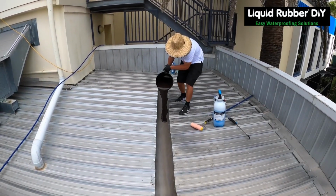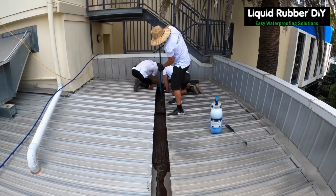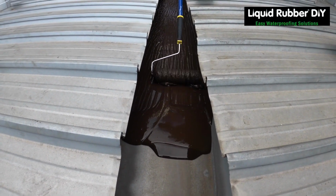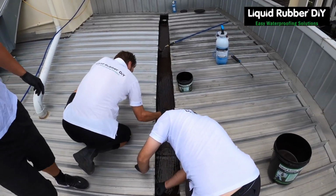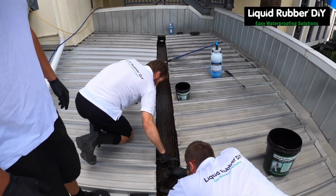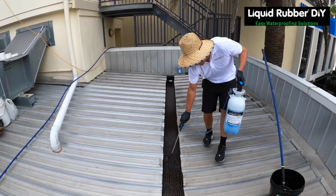Stage three, we're going to apply waterproof sealant by brush and roller. Usually best with three people, in the shade or afternoon or early morning. One rolls, and the other two brush both sides. Rapid cure spray. Like to let it settle a bit to try and get the roller lines out.